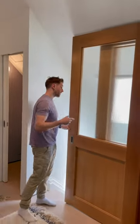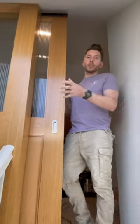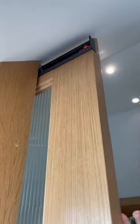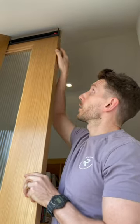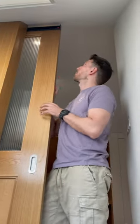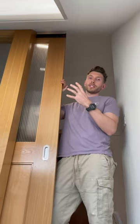Now if you come to this side, this system works almost in the opposite way that traditional track door systems work. In this case, the track itself is mounted on the door. Whereas traditionally the track goes on the wall and the door has wheels that slide in the track, this one has the track routed into the door and the wheels are stationary in a fixed position. Most people would agree that's not too ugly because the hardware gets routed into the door itself — it's not just hanging on the outside.